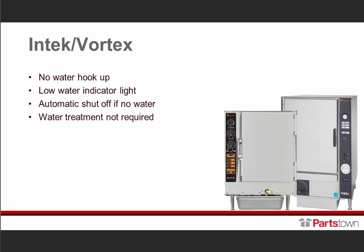The Vortex, being all electric, has an automatic hold that sets at approximately 165 degrees. One application you do not use in these open water reservoir units is shellfish. Inside each cavity it's basically like a pot with water, and the heating source brings that water to a boil. Shellfish secrete fatty proteins and salines, and when that hits the boiling water, it forms up and causes a huge mess. So these are batch cookers and no shellfish.